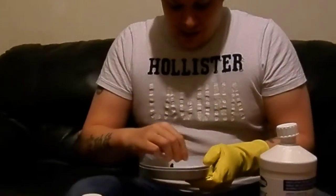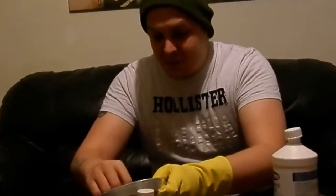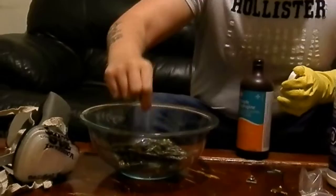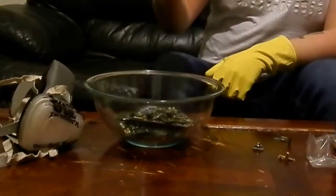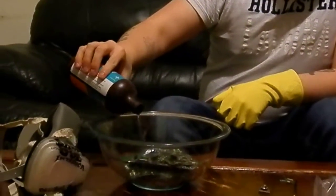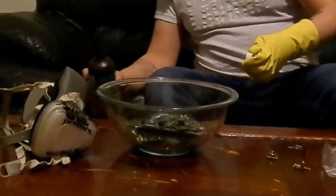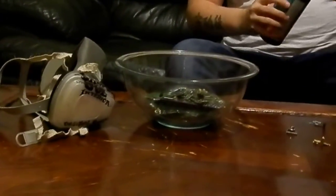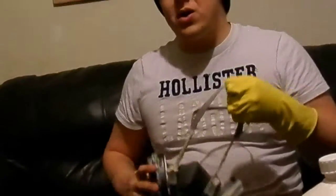So we've got our gold — I want to make sure I get it all in there. Don't worry if there's plastic already in there, you're going to be screening it anyway. So you want to start by getting your hydrogen peroxide. There's no real ratio, but you want to add your hydrogen peroxide first — it's going to act as a catalyst to speed up the process. Just cover all the circuits. You're going to be adding more muriatic acid than hydrogen peroxide.